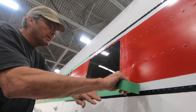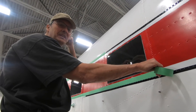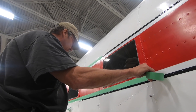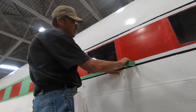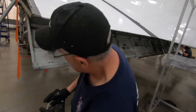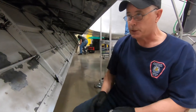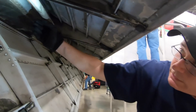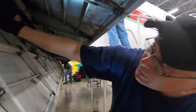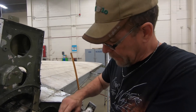What's the update? Well for a change today I'm painting - doing the right side now, done the right side yesterday, left side today, nose, and if it dries up probably doing another coat on the inner side of the wing. What's happening here with the flaps? We're just taking off the corrosion and making sure all the cotter pins are in and then lubing it up. For 75 years old it's just surface corrosion - very light, actually surprising for sitting out 28 years. Just a bit of dust, so we'll clean it up so it slides well.